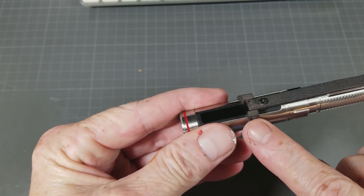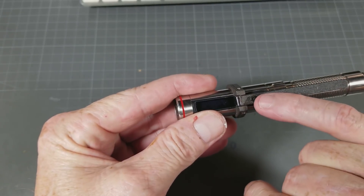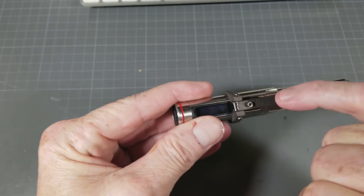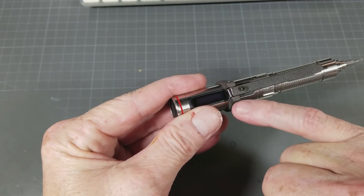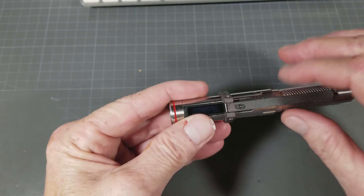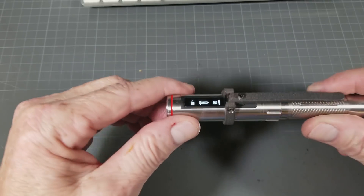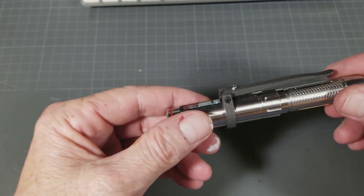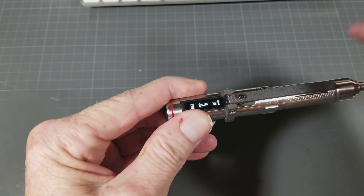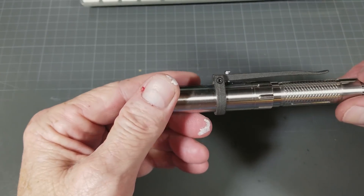This is using a 12 millimeter M2 cuphead bolt. Here's a 6 millimeter cuphead bolt. I had to use a tap and then thread this hole here M2, and this hole here M2. Then through here I oversized the holes to make sure the bolt fits through nice. The bolt was a little bit tight through the through-holes, so I'm guessing that's from printing. I oversized that a bit to make sure we've got a nice loose fit on this hole and the hole that goes through the lever, then tapped on this side to M2 and tapped here — and that's basically what it comes down to.